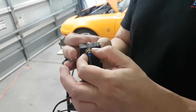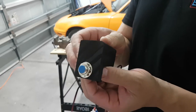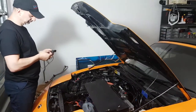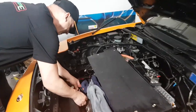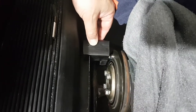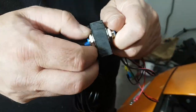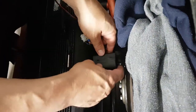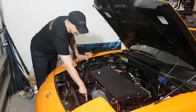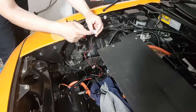The reason for setting this up now before the car turns is that the magnets have a north and south polarity and I'm not 100% sure whether the magnet should point north or south to the sender. So we'll test that right now. That will sit in there — as you can see it's a very tight squeeze. I might pull it back a little bit. That looks pretty good. We've got the unit installed and connected to positive and negative with a 4k7 resistor between the signal and the positive.